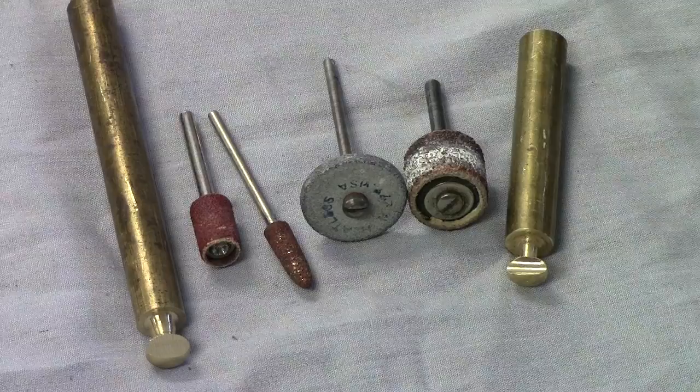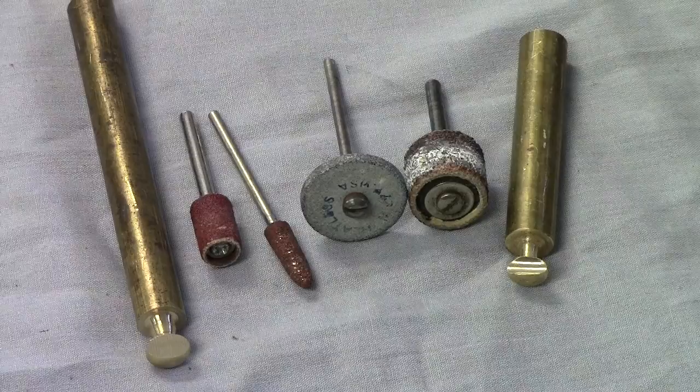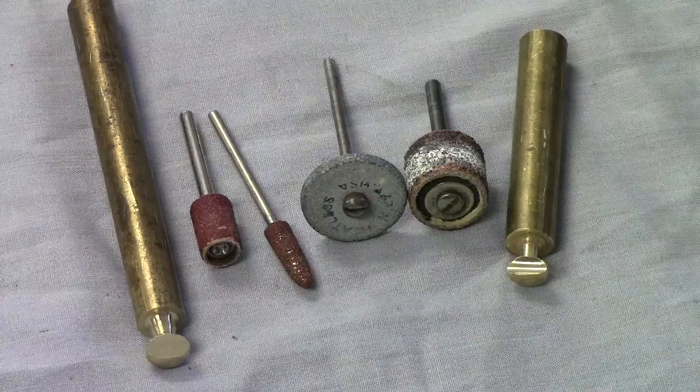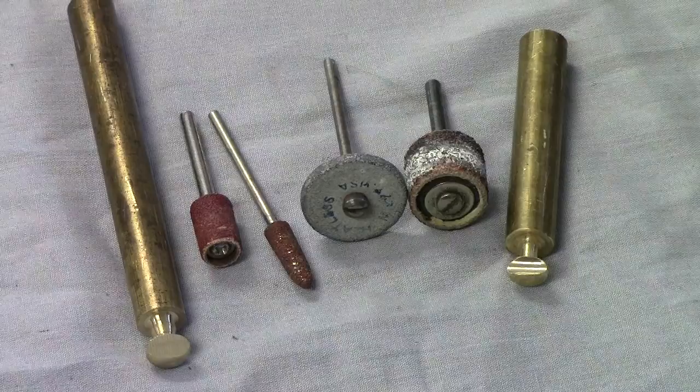As a matter of fact, when I'm turning with the slitting saw, I tend to err on leaving it a little proud, particularly if I'm going to cut a hole in the thumb screw, or it gives me a little room to fine-tune the profile and polish it up. But this is a relatively fast operation using sanding tools and grinding wheels, because you're not dealing with that much stock. So with that, let's take a look at cutting these on the horizontal mill.